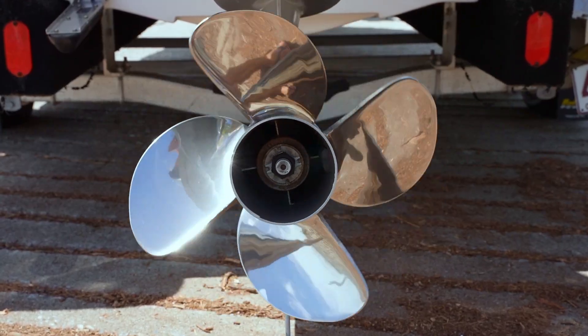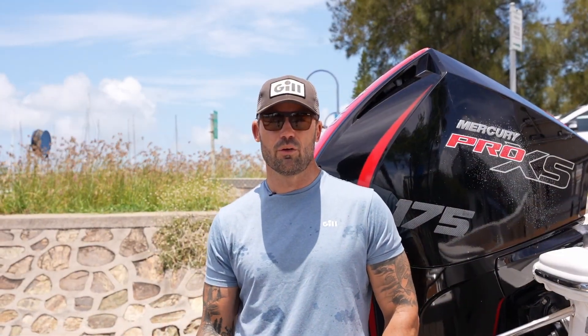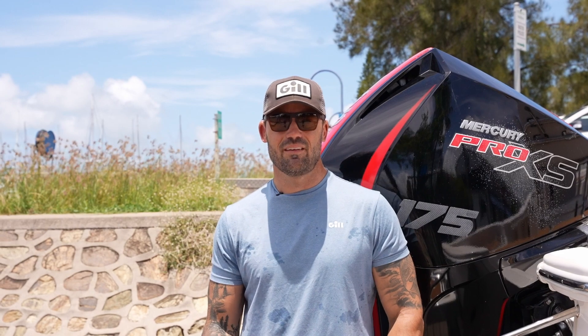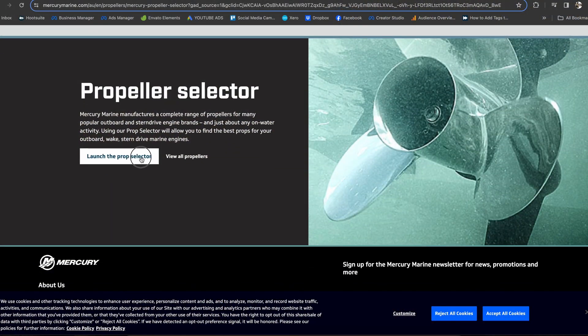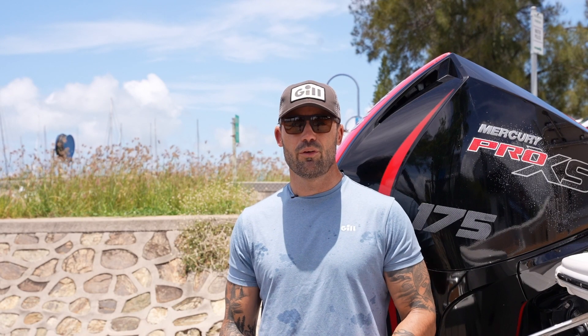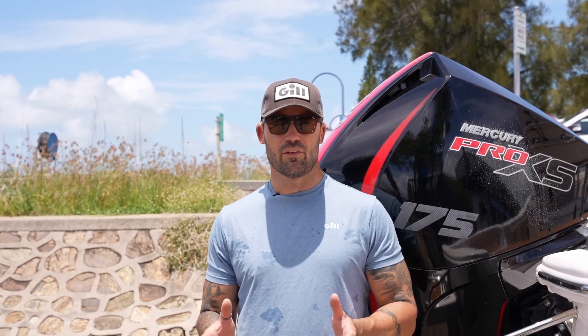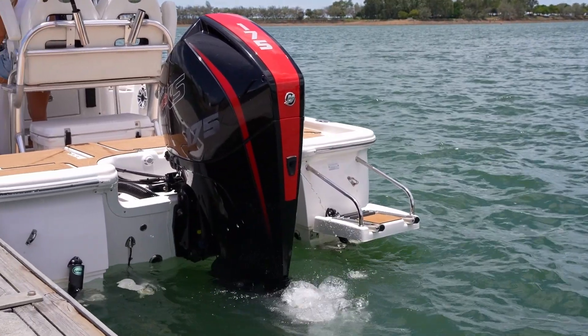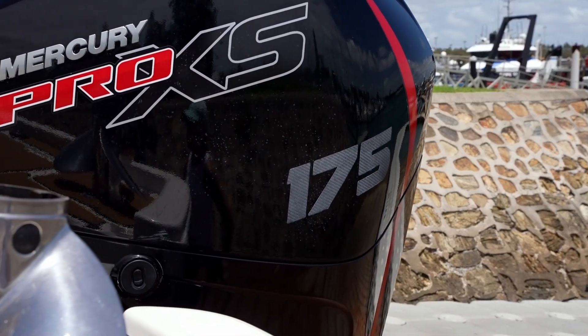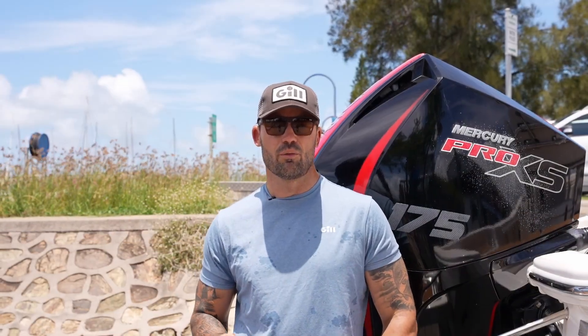If you're looking to improve the performance of your boat by upgrading your prop, you can jump online to the Mercury Prop Selection Tool, enter your boat details, and it will give you a range of props to suit your situation. Better still, go and chat to your local dealer. But before you do, arm yourself with some information: what are the maximum revs your boat does at full throttle? What inadequacies do you want to improve — is it using too much fuel, struggling to get on the plane, or struggling to keep the nose down? Those bits of information will help your local dealer give you the right prop.